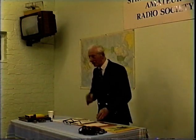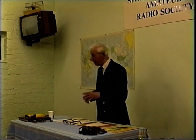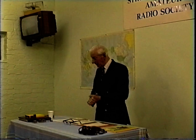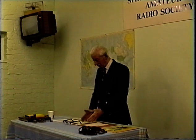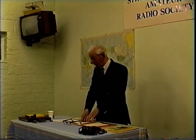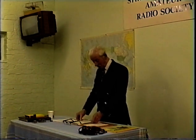He said, is it any good to you? So I took the box up to my room and there were one or two old variable capacitors — some of them pretty rough by today's standards — but I could use them and clean them all up. I had a rough idea of the maximum and minimum capacitance. So I got them all fixed and put them together. By this time I had built this little receiver which was just a regenerative detector into one audio stage, and I got the reaction going quite well. It was quite smooth. I was hearing odd signals on it because I had built a little power supply — an old transformer had been given to me by one of the fellows in the WT. It was very simple but seemed reasonably stable.